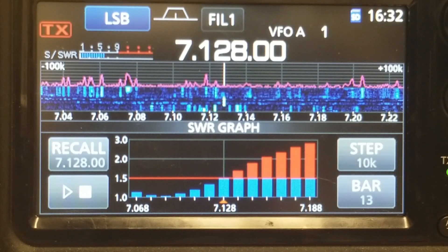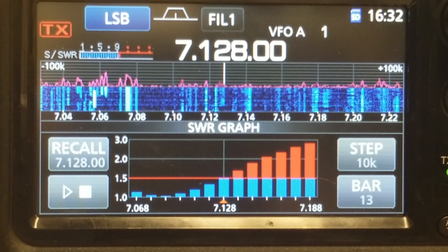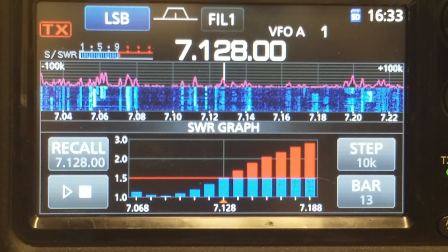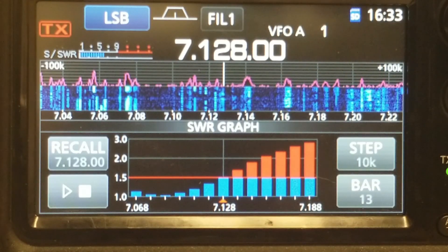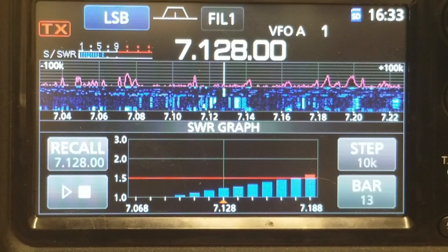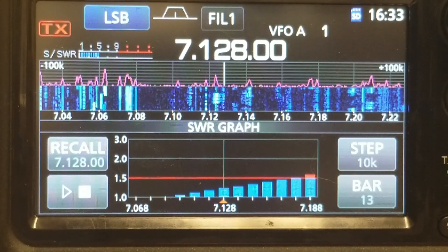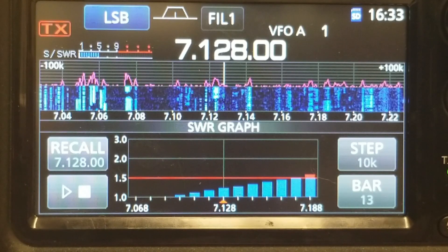You can see the high-gain is tuned a little low in the band — I can tune this with the radio, no problem. But if you remember from the previous video, we knew we were a little low and it was so hot back in the summer we didn't take the antenna back down to adjust it. That's where the high-gain is without any tuning — the tune is not on, so this is what the radio thinks it sees. Now I'm going to use my A-B switch and let's switch to the NFED. You can see the NFED is quite a bit flatter. It is, again, to the left a little bit on the band. On 40 meters I don't really want to go below 7125 — 7128 is about as low as you want because you're in lower sideband. You can see it's a little bit better on the SWR without doing any tuning whatsoever.